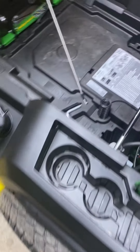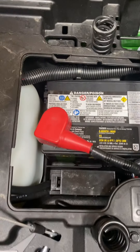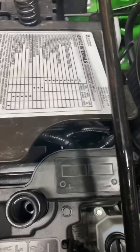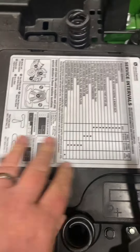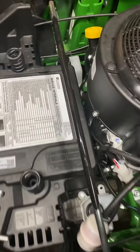It seems well built. Over here you can do a one-handed lift — pull that off and there's your battery. I like how it's covered, protected, and sits in there. Very easy to get to if you should have to. And obviously all your service information is right here — all the hours you should be doing maintenance at, belt tension, all that stuff.